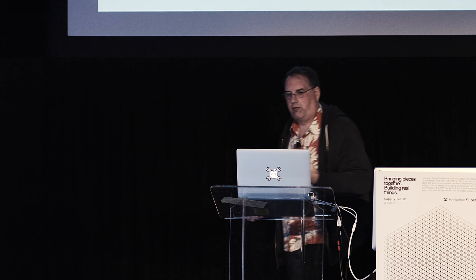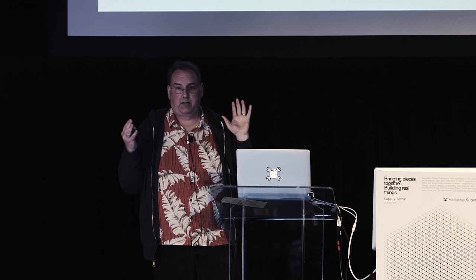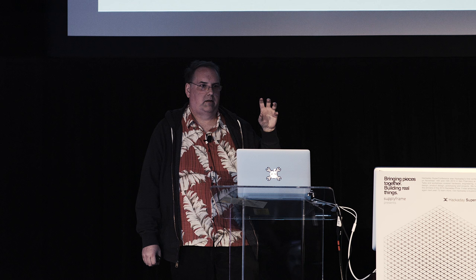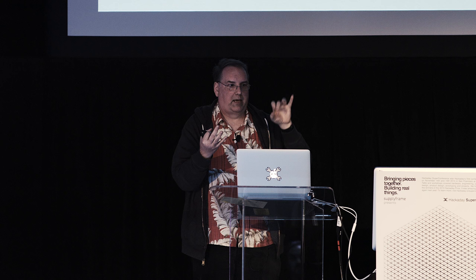One of the things I learned how to do in making enclosures, you get the extruded aluminum enclosures. Again, I give credit to Dave Jones for this. You can get printed circuit boards fabbed to make the front panels of them. That's a great technique. One of the things that happens if you go to Dirty PCBs, though, is they'll put a code number on the front of your board, and they do that for internal tracking purposes. OSH Park doesn't do that, but Dirty does. On a board that's going inside an enclosure, I don't really care about that. But when they put the number right on the front panel of your enclosure, that's not so nice. So now I've got a pile of those that have a code number on the front that actually shows. If I'd remembered that at the time, I would have flipped the Gerbers around so their code number would have been on the inside of the front panel, and I wouldn't have cared.